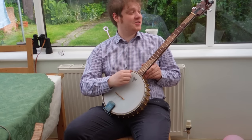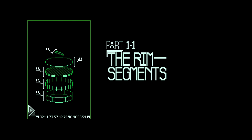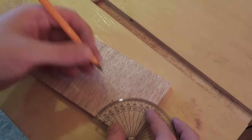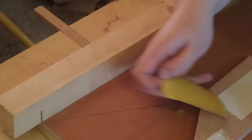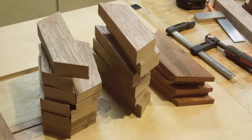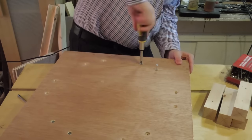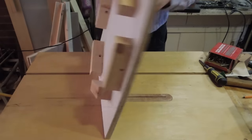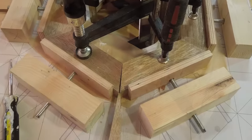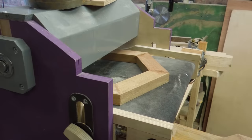In this video I'll show you how I made this banjo. I started with a rim which was made from segments of construction timber, which were cut to 30 degrees on each end. I made a clamping fixture to try and make gluing each layer a little bit easier. I didn't get the angles exactly right so I glued them up in halves. The hexagons also weren't completely flat so I flattened them with a drum sander.